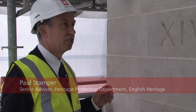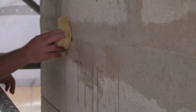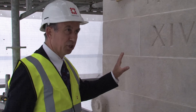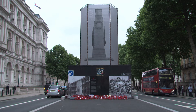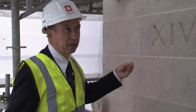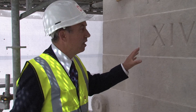What we're doing is essentially three things. We give the cenotaph a good wash and brush up once a year anyway, but this time we're steam cleaning it very carefully because we don't want to erode the lettering and so forth. Secondly, we're using quite advanced chemical poultices to draw out some of the real deep-down dirt. That gathers for two reasons: firstly, there are plane trees around the cenotaph and the sap and so forth does gather and stick, and that problem is made worse by the diesel fumes — the diesel particulates that form a particularly grey-black gunky mix that settles particularly in any ledges and crevices.